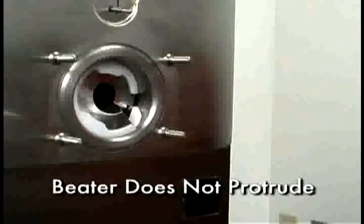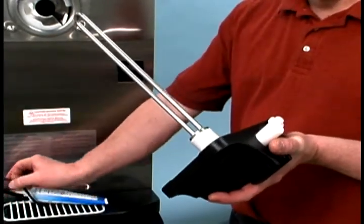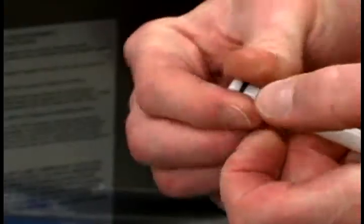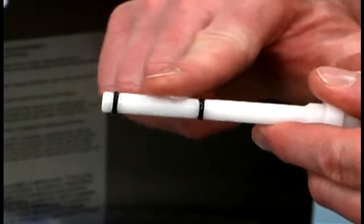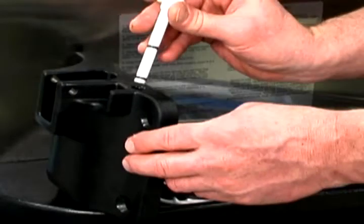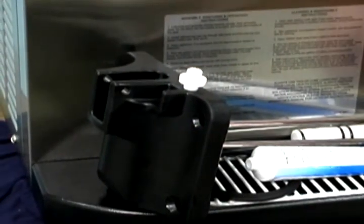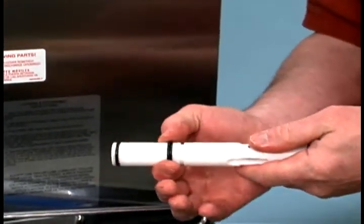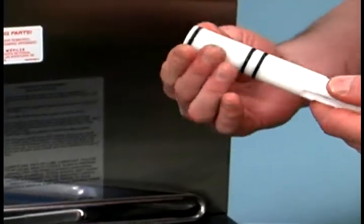To assemble the freezer door, slide the white plastic front bearing over the baffle rod onto the bearing hub, making sure that the flanged end of the bearing is resting against the freezer door. Slide the two O-rings into the grooves on the prime plug and apply an even coat of lubricant to the O-rings and shaft. Insert the prime plug into the hole in the top of the freezer door and push down. To install the draw valve, first slide the valve's three O-rings into the grooves on the valve and then apply lubricant.